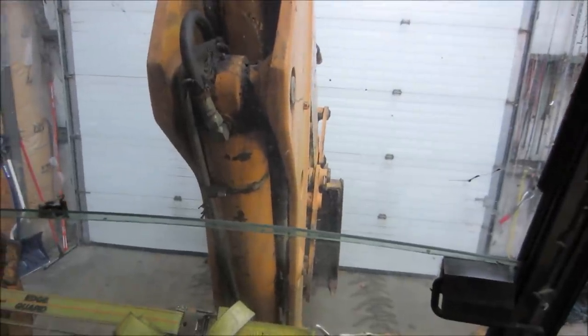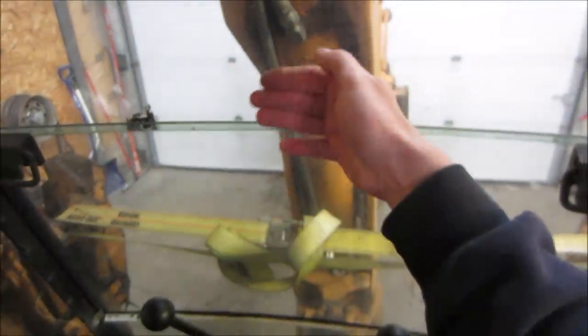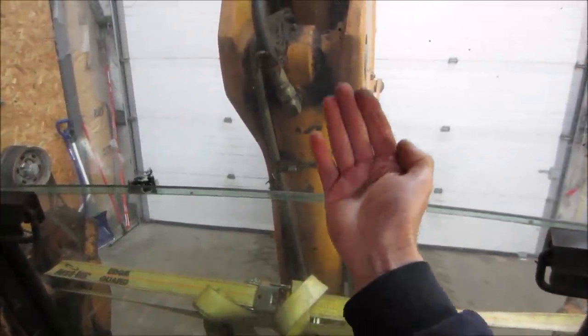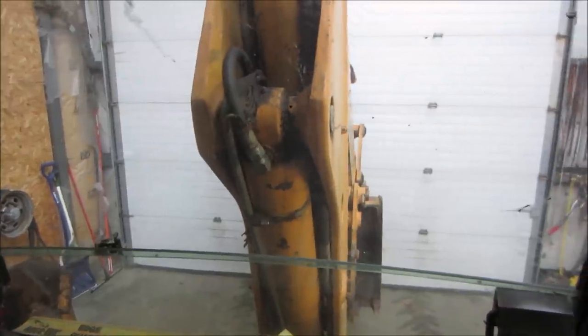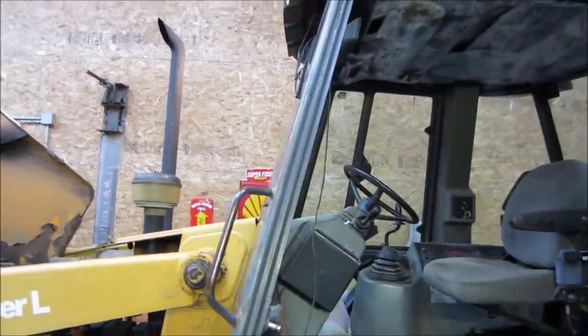And I said I screwed up, I was going to leave the tractor. I didn't think it had enough hydraulic pressure to do what it needed to do. And at the very last second, you take the stick, you're pulling it forward like you got the boom coming in, and you push it forward, which is totally counterintuitive to what you think it would do. It kind of free floats, and just the momentum of it clicks in and locks it into that travel mode. Now I know.